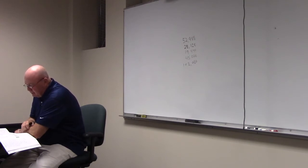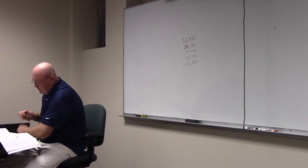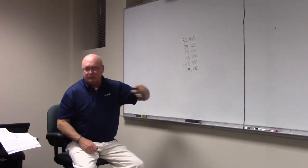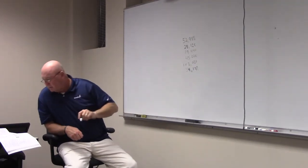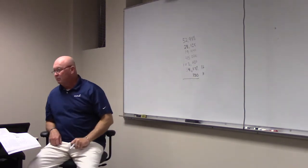We've got the dryers, and we know that they have to be 5,000 each, and they're times four. House lighting, we see that they said there were 60 watts times 40, and it said there were three general purpose outlets. And how much is a general purpose outlet? 180 volt-amps. And so you see there the house total then is 34,172. You take the biggest motor, you got to get it times 25%, and so that's 720. So we got all this right here, and we're adding 34,172. And how much was the biggest motor? An extra 720 volt-amps. So this is house, and the rest of that's just apartments. We good?